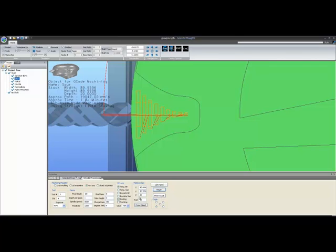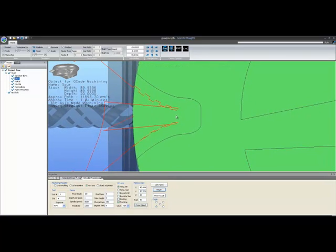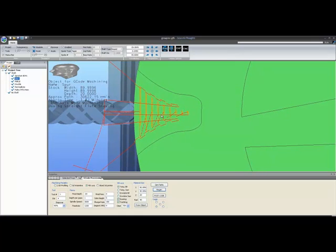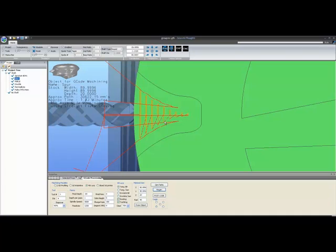rough. If you then turned off rooting and turned on toothing and generated the toolpath, you would get a file called spur fine. And if you have them both on, you will get a file called spur rough fine, which tells you that one tool is doing both the finishing and the roughing both.